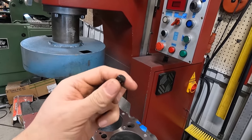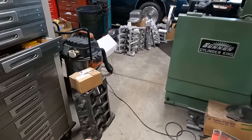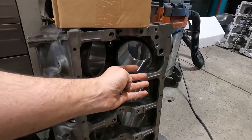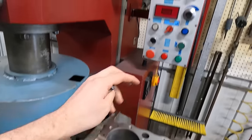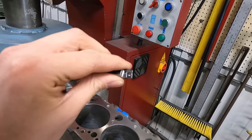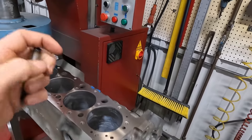I'm testing out some new cutting inserts and the one I used on this block leaves kind of a — it looks like a nice finish, but it feels all jagged and it's not very nice. I don't think our spindle RPM is high enough to use that. So we got a recommendation to try this particular insert, so we're going to see how that goes.